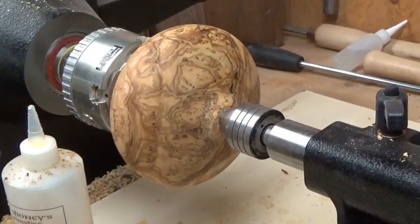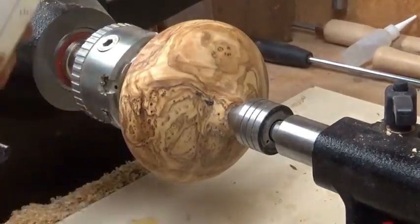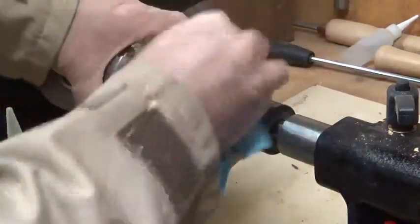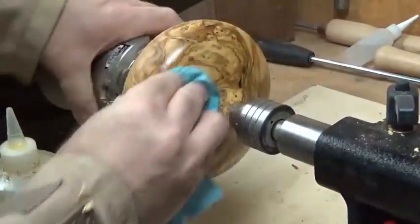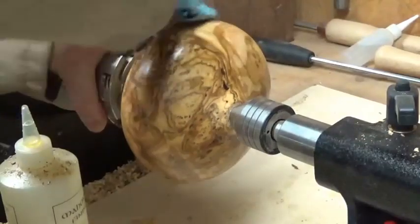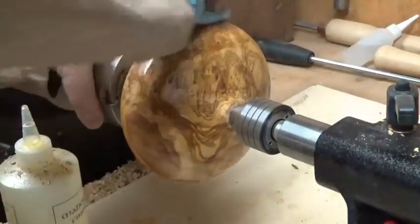So just if it interests you as well, I've just sanded this to 150 grit dry, and now I've applied some oil as well. This will enable me to wet sand it, and it will reduce the dust and also really show up those scratches so that I can hopefully get the best finish possible with no tool marks, no sanding scratches or anything. And again, sanding forward and reverse will help you get a much better finish as well.